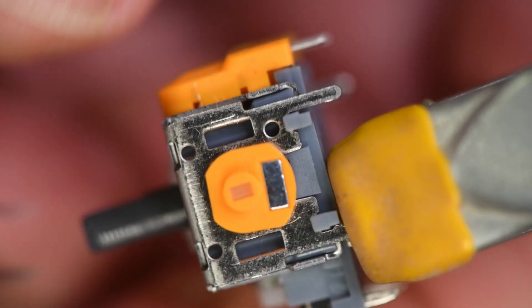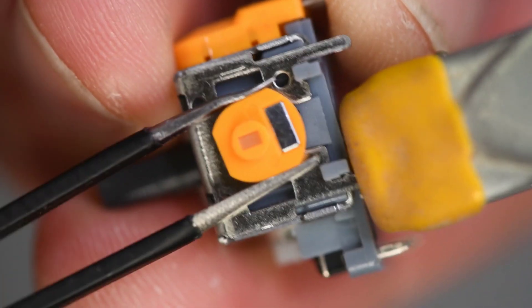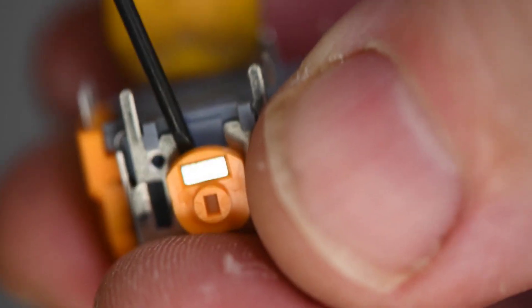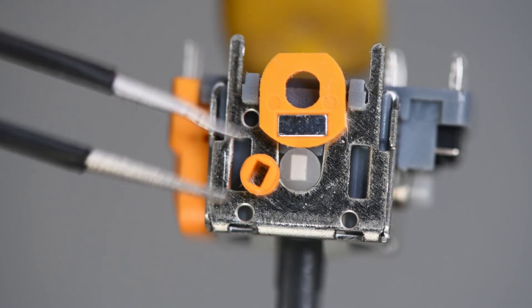These joysticks have to be center adjusted — or maybe better to say, can be adjusted to the center. The part holding the magnet can turn a slight amount apart from the shaft, and it's pretty tight, but it would need to be, since a controller has to handle a high amount of shock. It's relying on the friction between the two pieces to hold its alignment. The flat on the inner piece being a bit smaller than the flat on the outer piece allows the adjustment range — about as simple as it could get.